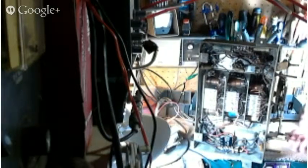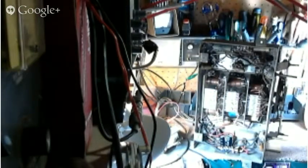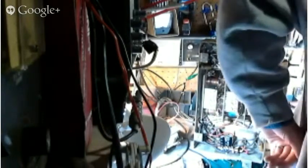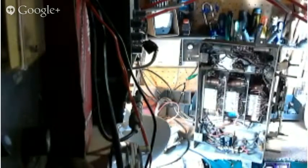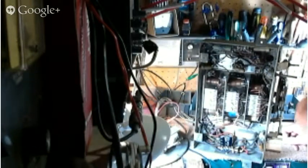We have no antenna on here, and that's on purpose right now. And the band we're on, we're on the broadcast band at that point. I'd say we're all set, so let's bring on the power to the plug on limiting. Put it on limiting just in case. What happens is if there's a short circuit in the radio, the limiting light bulb will glow very brightly, telling me that the radio is pretty much a piece of wire instead of a radio. But here we go.